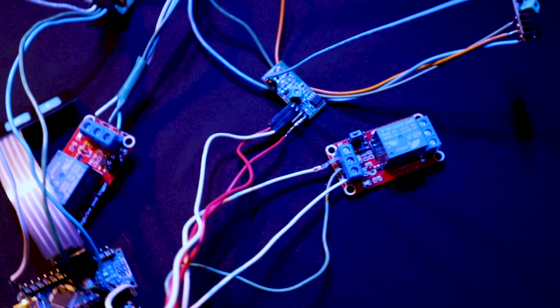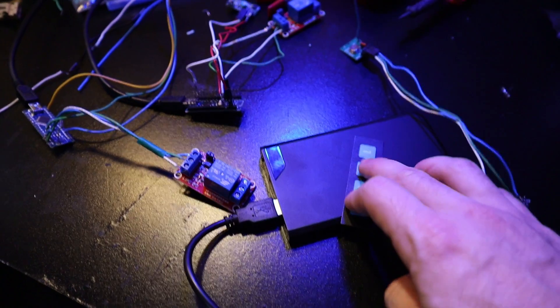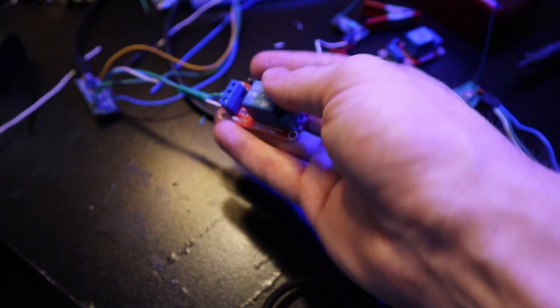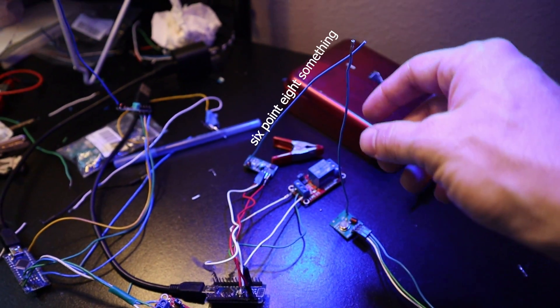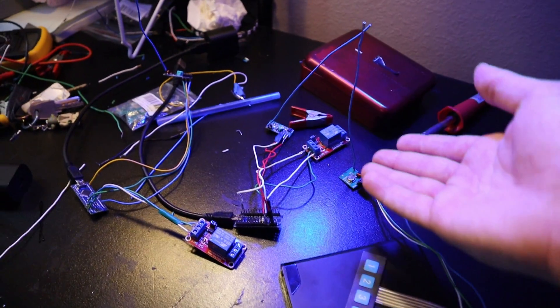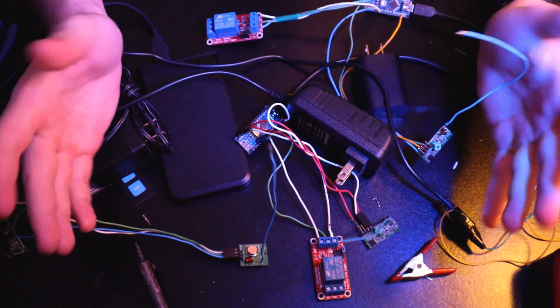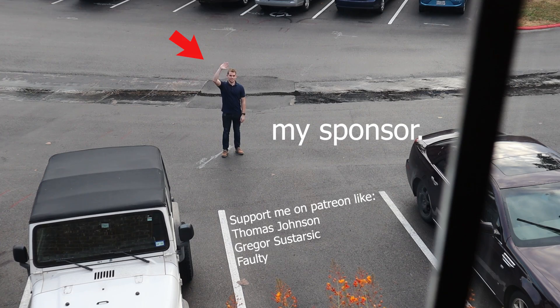After many hours of breathing in lead-full solder, this is what I came up with. I have three Arduino nanos. One is going to be the transmitter with just this number pad where I can put different functions on each of the buttons, a 433 megahertz receiver, and I also bought little simple relay boards. To actually get range out of all these, I needed to put an antenna on this — I cut it to 6.8-something inches, or 17.3 centimeters. That's a quarter wavelength of a 433 megahertz signal. In addition to these parts, I also got a couple power supplies. All of this stuff — I want to take a second to thank my sponsor. I couldn't have done any of this without them, so big shout out to them.